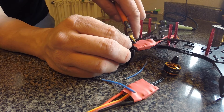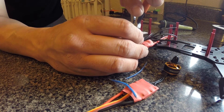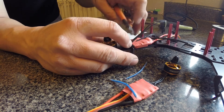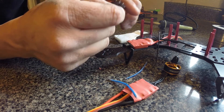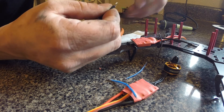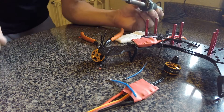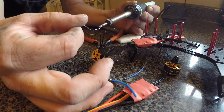This time I'm not going to go a quarter inch back — I'm going to go a little shorter. I'm going to snip the center one to the length I want, and the other two are going to be a little bit more length. The center wire is actually the outside wire, and the other two are going to be obviously a quarter inch longer — ish. I always say ish because I don't exactly use a measuring tape; if I'd guess, it's an eighth to a quarter inch. We just need them a little bit longer so the wires lay next to each other when they finish. Give them a little bit of a spin so the wires don't fray when you solder. You want a simple, tight wrap with solder so it's really easy to connect and bonds better.